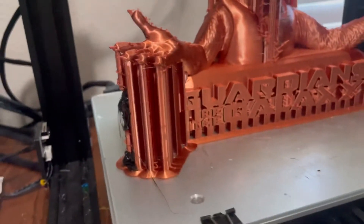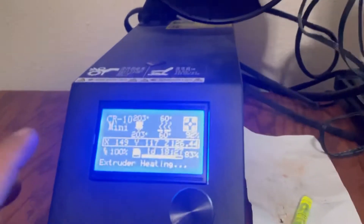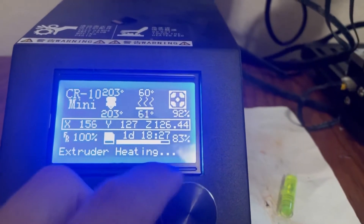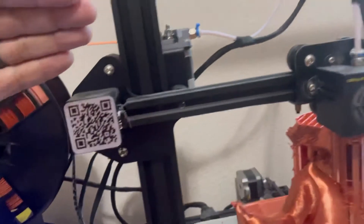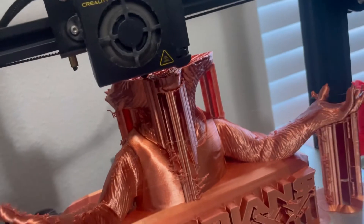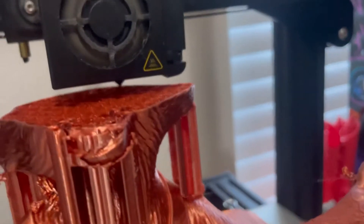So here's what I recommend doing if one of your supports blows out. The first thing you want to do is turn your feed rate down. You can see I'm printing at 100% — FR stands for feed rate. Turn it down, but not so low that it affects the print. When you turn your feed rate down you're reducing the rate of filament being fed through. If you turn it down too low it can ooze out so slow it cools before it forms and ruins the print. I turned mine down to about 70%.